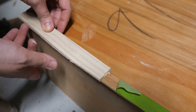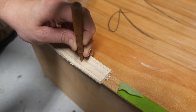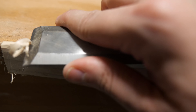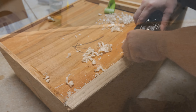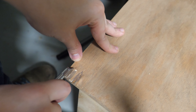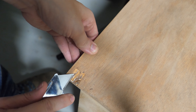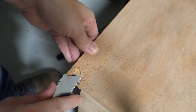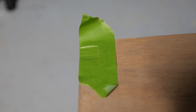I'm going to build a custom base for this dresser that fits the style of the top drawers better. To do that I need to cut off the bottom half of the dresser, so I started by removing the support pieces and the legs. I put down some painters tape to help stop the veneer from splintering and then I used my jigsaw to cut both sides off.